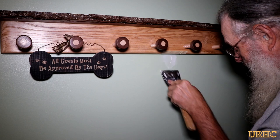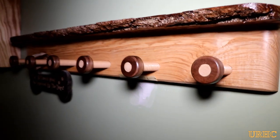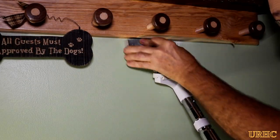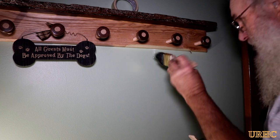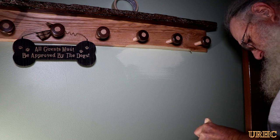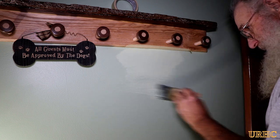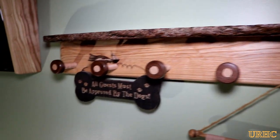There it is all done except for the one mess-up where I put a gouge in the wall. That was a matter of getting a little bit of tape and compound and putting a coat on there. I used the vacuum to help with sanding and just touched it up in a couple of minutes. Luckily I still had paint left from the room — you just have to try to feather it out a little bit because you can see a different texture when you brush it compared to how it looks rolled.